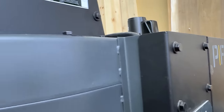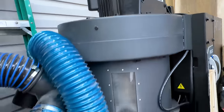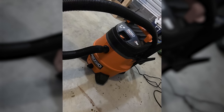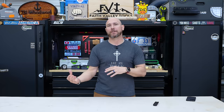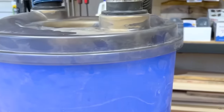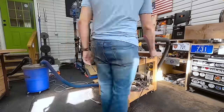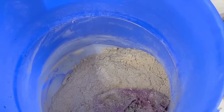Next on the list is dust collection, and this is a big deal for a lot of people because dust collection can be pricey, but there are ways to work your way up to it. When I first started, all I had was a Ridgid shop vac — use what you got. A shop vac fills up quite fast when you're using table saws, but a good way around that is to use a dust separator. I bought this Dust Right separator and it works really well — I've used it with a CNC, table saw, even the planer. It filters out the big chunks before they go to your shop vac so it doesn't fill up and clog your filters as fast.